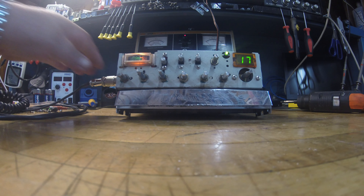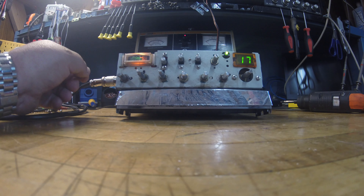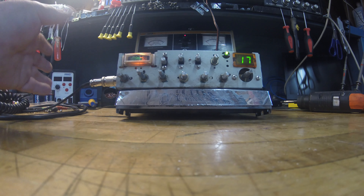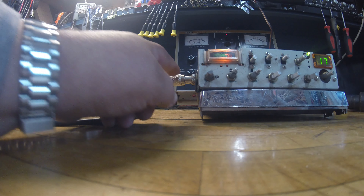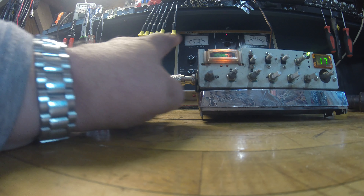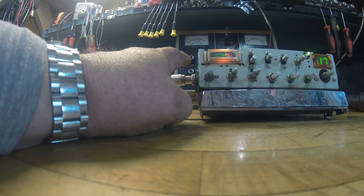By the way, I found a cool little adapter. I didn't even know they had it until I was out there looking for some 5-pin to wire a mic. They've got these little adapters which for me on the bench is wonderful. I don't know — in a vehicle it might make it stick out a little further. But what it does is it converts a 5-pin to a 4-pin Cobra, so any 4-pin Cobra mic will work on the 5-pin Cobras and President radios.